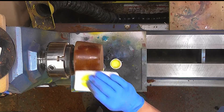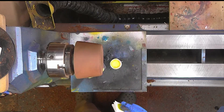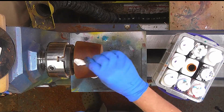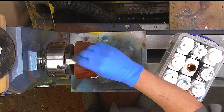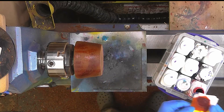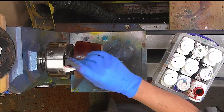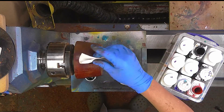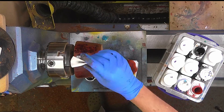Now this is yellow spirit stains — my usual, favoured combination: yellow, orange, red and a bit of black. You can see the yellow is making a difference, even though the wood itself is probably darker than the yellow. Bit of orange going on, not quite so heavy coverage, not so uniform — trying to get a sort of mottled look going on. It really doesn't respond in quite the same way as it being on a lighter piece of wood, but it does add some warmth to it. You can see it's changing the colour against the uncoloured wood at the top of the picture. A bit of red and a bit of black as well, just to run through the colours and see what happens. Maybe a bit heavy-handed with the black, but I was more interested in seeing how it actually took the stain.